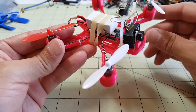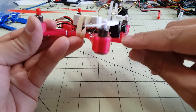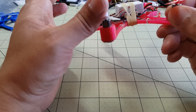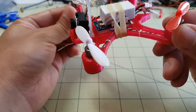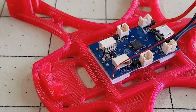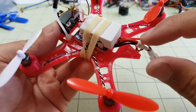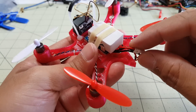One of the reasons I got this 3D printed frame is it has this angled mount area for this particular camera, giving you a little bit of camera tilt. It's the same size footprint as the other builds, but this one has sockets for the Dark Edition motors — they come with plugs. To connect the camera VTX to the Siski board, I just used this small pigtail back here.